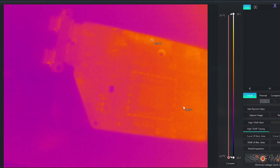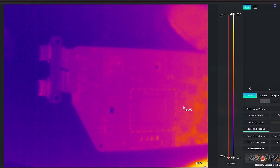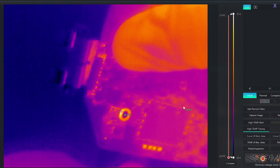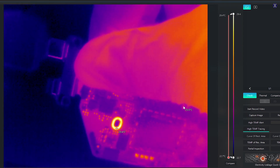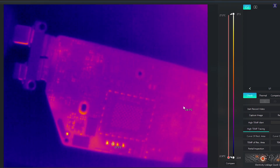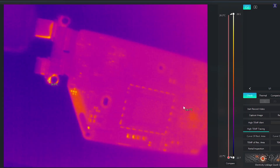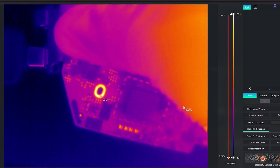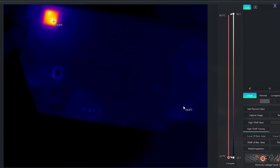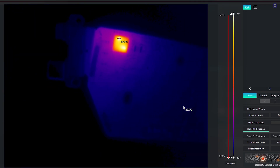So let's see how the board is reacting with thermal imaging. I'm going to plug in the top port and let's see — I might need to hold it from the bottom so it doesn't disconnect. So if I plug in the top port there, no voltage. It looks completely dead, and it's plugged in. Let's switch it up. We know the voltage is coming from the bottom one, so we plug in the bottom one. Wait a minute, that doesn't seem right — why does the bottom one make the top connection go a little bit warm? That's very strange.